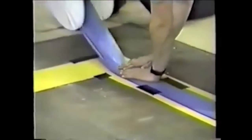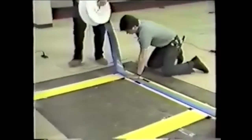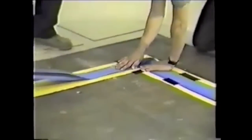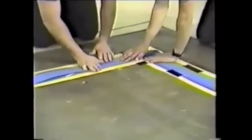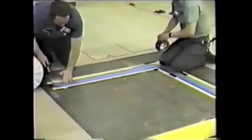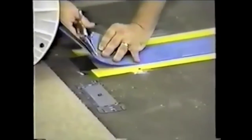If a directional change is required, roll the additional cable off the reel and fold the cable by hand at a 90-degree angle and press the folded area flat, and then continue to unreel the cable off the roll to the end of the circuit run. Using a pair of sharp cutting shears to eliminate any burrs, cut the cable off the roll.